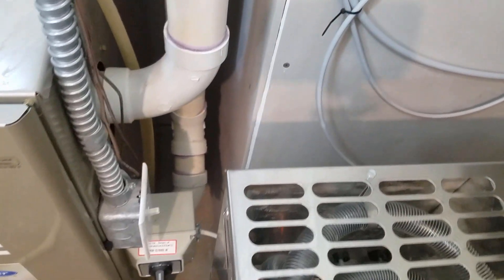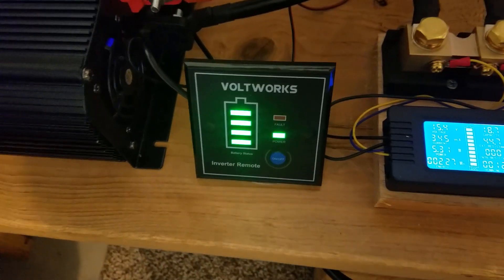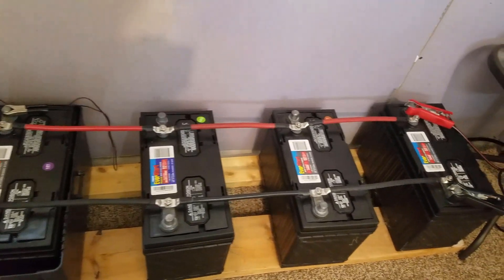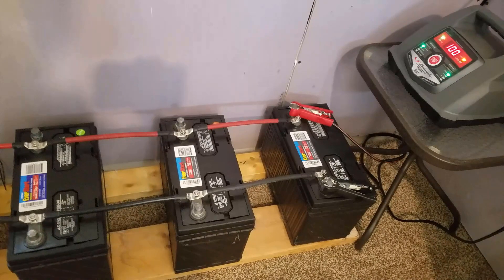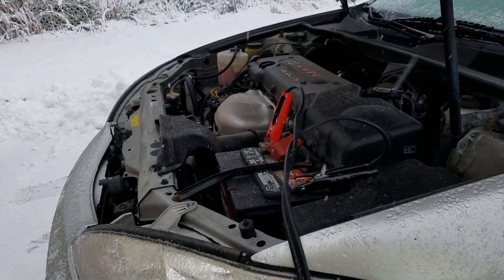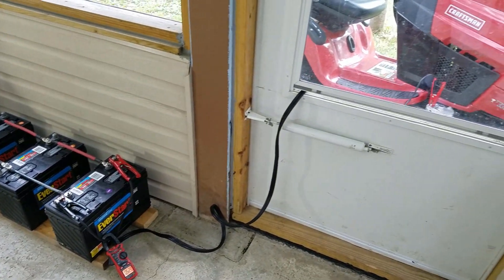This is the overview of our system for the complete setup. The inverter cable runs along the wall and around the hot water heater. The inverter is on standby mode for today — typically we turn it off. We have a 4-battery bank that is always being maintained by a charger. The charger is currently displaying 100% and should turn itself off after a few minutes. With this setup we should have several days of continuous power supply. But if the power outage lasts longer than several days, we can use a generator to recharge the batteries, run the inverter straight from a running car, or set up a lawn mower to recharge the battery bank. See the link below for the mower project.